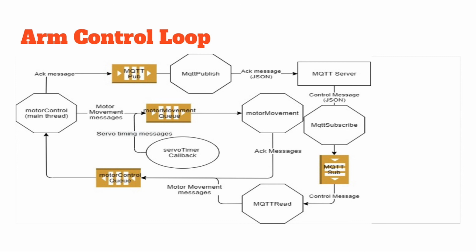Here's the arm control loop. It is broken down into 2 main sections. There's the motor control thread and the motor movement thread, and then the MQTT publish, MQTT subscribe, and MQTT read threads. The motor control and motor movement threads were part of the core control loop of the ARM, meaning that they were responsible for reading and executing messages in the form of the ARM's API.